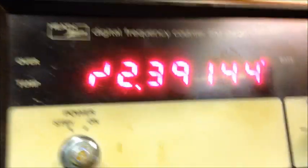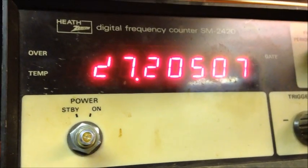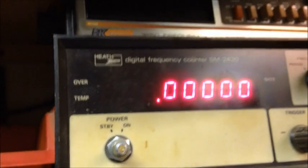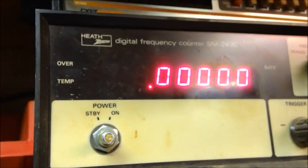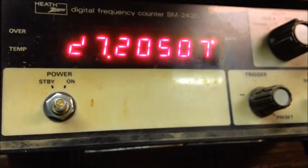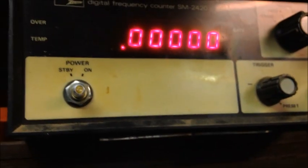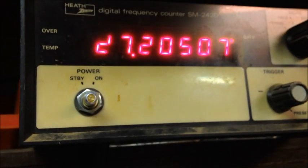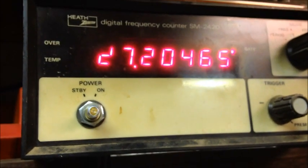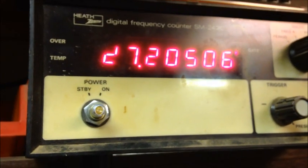And then let me give you a little hint on the wind-up, okay? Up is for the wind-up. Now, as you see, here's your frequency. This is how the wind-up works. That's your frequency without the wind-up on, okay? Now, with the wind-up on, watch what happens with them last three numbers. There we go. See how it does that? And that's on every key up. What it's doing is changing the frequency as you're keying up. And that's what makes the wind-up sound.